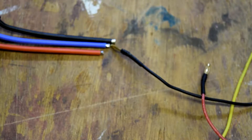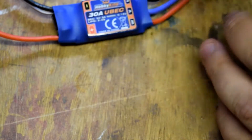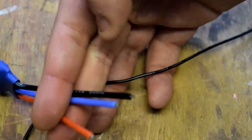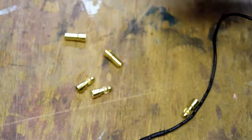I don't like hard soldering stuff - it's nice and easy to swap stuff out if they've got connectors on. I'm going to decide whether to put 2mm bullets on these, which I'm never going to get those wires in, or stick 3mm on these and be cautious with them. I'm actually going to put 3.5mm bullet connectors on each end - female on the motor, male on the ESC, same as what's already on it, just the next size up. I bought a load recently from Banggood. Three males, three females - so females on the motor, males on the ESC.